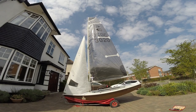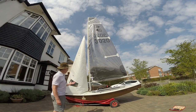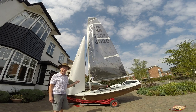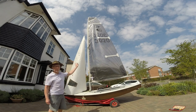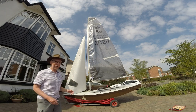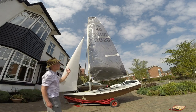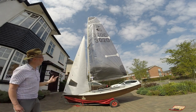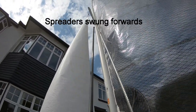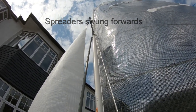So unbelievably I've just proved my point. The mast is very much straighter than it was - you can see that - and that's with the same settings. All I've done is move the shrouds forward with the spreaders, and that's just flattened the mast in the middle where the spreaders are. What it's done is made the sail a bit fuller - in fact the sail with the original settings wasn't filling properly, and now it's got a nice shape. You can see the deflection from the spreaders pulling forward and that's flattening the mast in the middle.